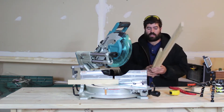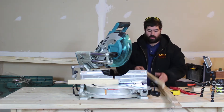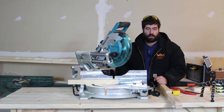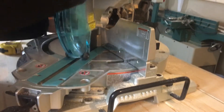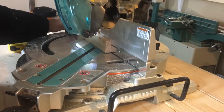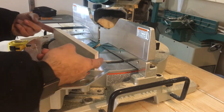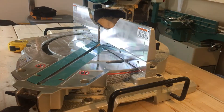That way I make sure that everything was cut exactly the same width. Now we're going to go cut those on the miter saw. We're actually going to be putting a 45 on all the pieces. We're going to have four pieces at 13 inches from long point to long point, and four pieces at 5 inches from long point to long point. So we'll cut those now. First I'm going to cut a 45 on this one, then I'm going to make a mark of 13 inches. You want to make sure that your two bevels are perpendicular to each other. Now I'll just cut more of those.